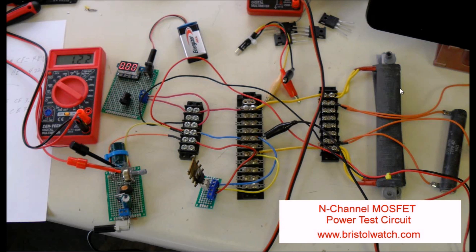Here is my actual test setup. On this side you'll see several high-watt, low-ohm resistors connected in parallel - they're going to be my load, coming out to a little over three ohms. This meter is connected to a small variable switching power supply connected to a wall wart. This allows me to adjust the gate voltage on the device under test, which is a socket with screw terminals. I put the test MOSFET on this heat sink and just plug it in.